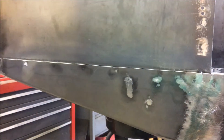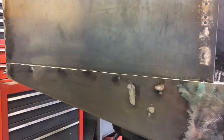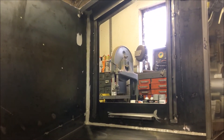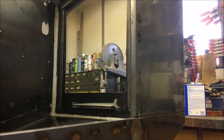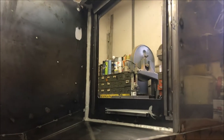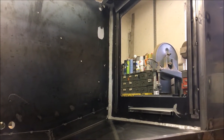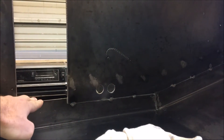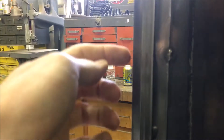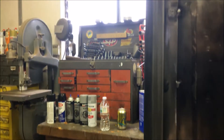You can see this is actually flanged — I got a flanger that I did the joints with. The ends are the only things that have the lapped or butt joints, just due to my limited amount of sheet metal equipment. Sort of got to build around my tool abilities. Everything that isn't the end pieces is all spot welded through. Mechanically flashed as I'm talking about — this doesn't need seam sealer because water can't get under there, like flashing on a house. This is the window track and the windows slide up and down in there.